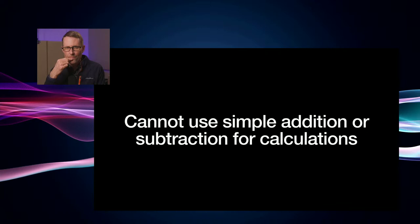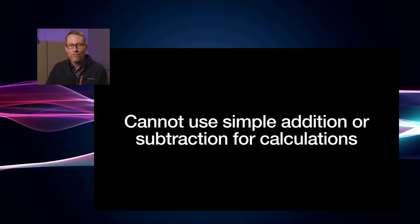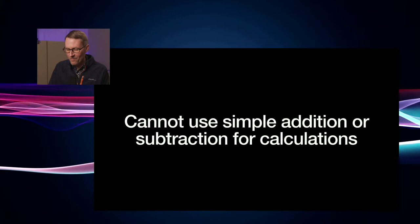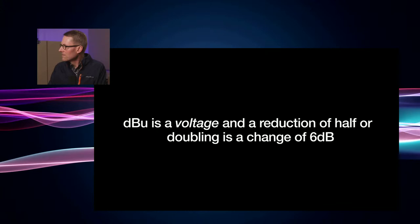And the question is, well, would it be 180 dB/SPL? And the answer is no, it would not. It would actually probably read right around 93 dB/SPL. Kind of mind-bending, you think, at first. But you have to be careful. Again, we're using logarithmic scales, and it depends on a lot of other factors. So that is a doubling of what you hear, though, right?